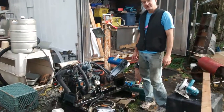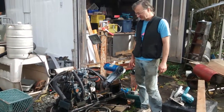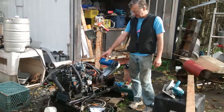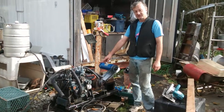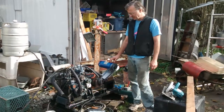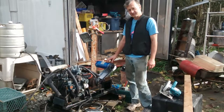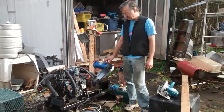This is a twin-cylinder diesel engine from a truck refrigeration unit. The starter motor didn't work, but we don't really need it anyway because that's a three horsepower, 36 volt DC forklift motor, and it's going to start the engine. Once it's finished — this is just in the prototype stage — it will also act as a low voltage generator.